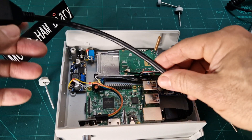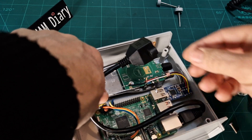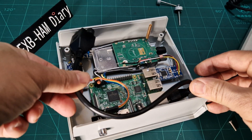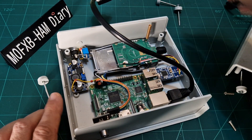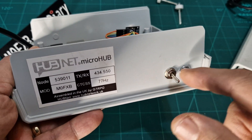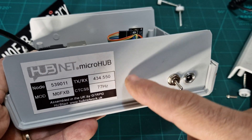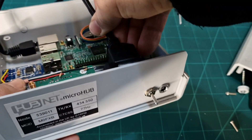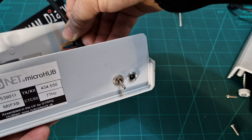The connector is in there. There's plenty of room in the box to decide where you want it to poke out — it's just a choice really. The front and back units come off easily, so it's easy to take them away and make the holes once you've marked up. We'll undo these two bolts holding the on/off switch and the DC connector, then take this away and try to make a hole about here.